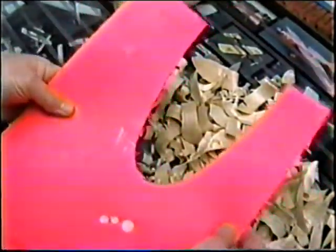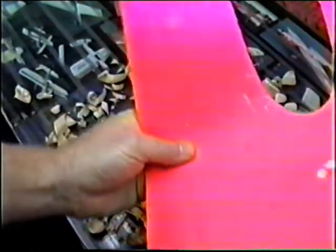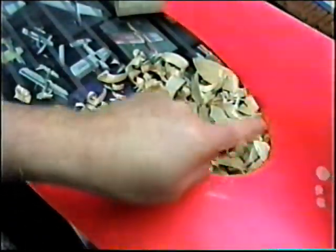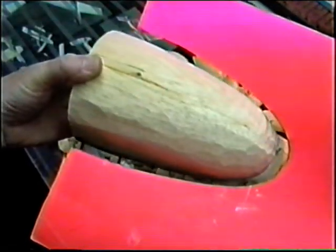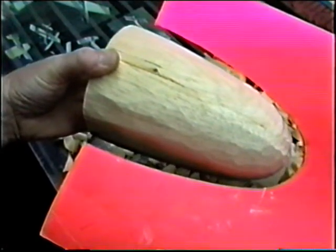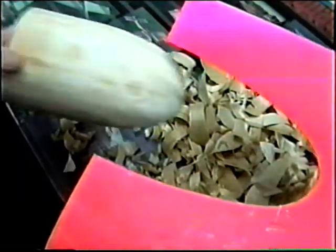Here's one of the things that you can do when you have to make two parts relatively the same. Well, what I did, I took a piece of just ordinary art paper, and made a cut that was about a quarter of an inch bigger than the part has to be. And now what you can see is, as you start shaping it, you can try to lay this in and see where your hard spots are. And you always want to make it a little bit bigger to start with, and let me just show you why. And this really does save a lot of time.